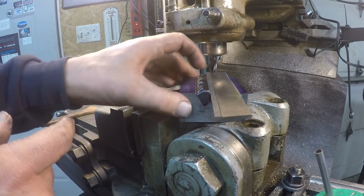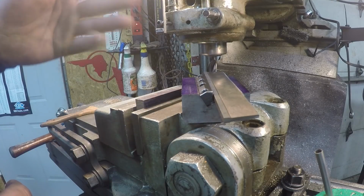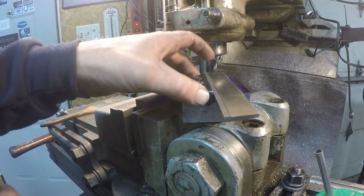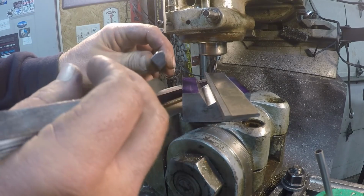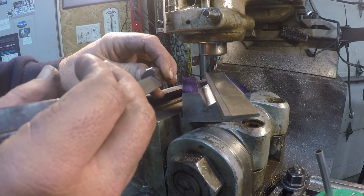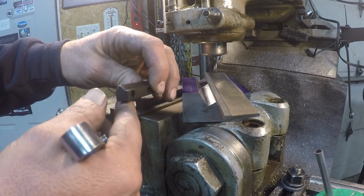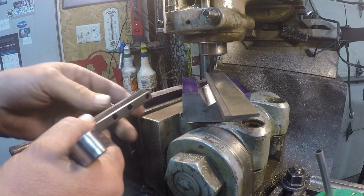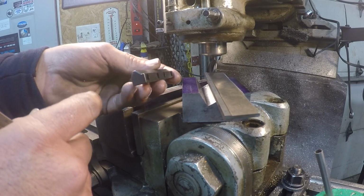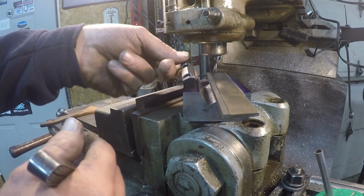I mean, that's where it'll end up being, but so I'm going to go from the side to get my thickness here. I'm going to go 400 thousandths, and then that's a little over 100, so I'm going to go 200 thousandths depth, and then I'm going to take it out and flip it, move my sine vise back to 30 degrees and cut this one.